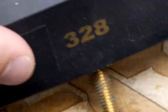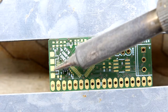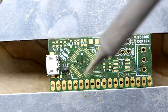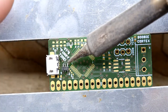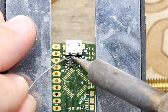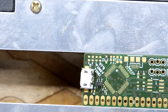Let's rotate this thing around again and get our first pin all tinned up. It's going to be tricky to solder those two pins. The pins are actually underneath the USB port - that is a tricky one. I've got a capacitor footprint right here. I could have done that a little bit better. However, this capacitor might be a ground so that doesn't matter so much if it touches. This goes to show how tricky some of these are - this is definitely more suited to the solder paste and hot air technique.